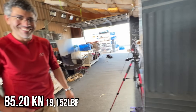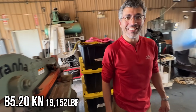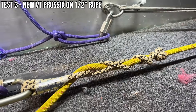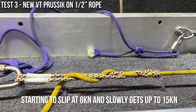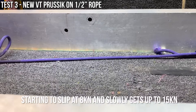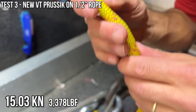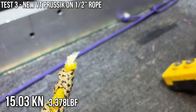Sure glad I have this thing. I'm standing behind a cutoff saw and two pieces of stainless steel. The next two things we're going to break are these two prusiks — one is well used and one looks really new. We're going to prusik these around a half-inch rope; if they don't break and the half-inch rope does, we'll pull them eye-to-eye to see if there's any difference between the new one and the used one. It was melting, getting hotter, able to grab more — it looks like it broke the rope. Feel that — oh wow, that's really hot. It didn't break it in the knot; it broke it where it was just pinching the rope. Feel the tip — it's completely melted, hard as a rock.